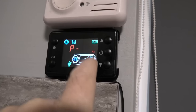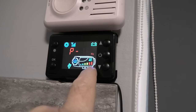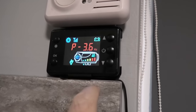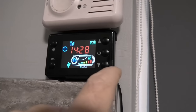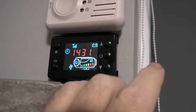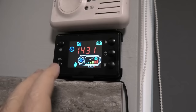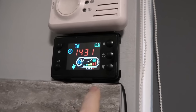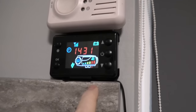That is the maximum fuel you can push through this system at maximum fan RPM. If you put any more through it, all you're going to do is kick out smoke, coke everything up, and make a mess. So I'm running at 3.6 Hz at 5000 RPM — that is my tuned maximum.